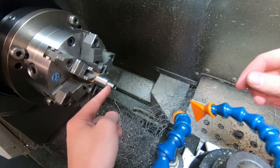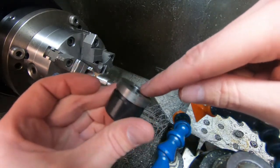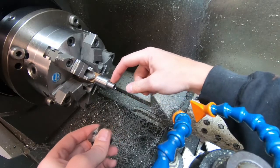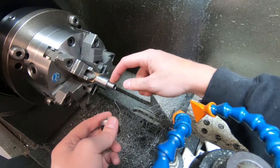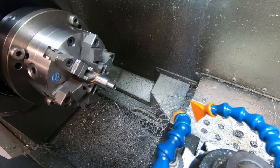I'll need to check if this requires an undercut. Some devices require that blank section at the back to be undercut if the threads run all the way out to the end like this. I may need to go back and cut that, but I'll consult with what the customer is putting on there. That blank section might get cut out so the threads go into it and seat directly on this shoulder. That's pretty much all there is to it - it's very straightforward to put a thread on, but the setup is what takes the longest. Getting that perfectly lined up with the center of the bore is everything. The CNC just makes it thread fast, controls it precisely, and threads right up to that shoulder. I already have the program set to cut to half-28 for a good snug fit on any attachment - not a sloppy loose fit. Thanks a lot.